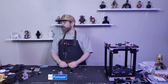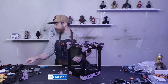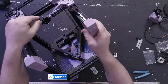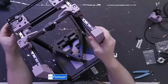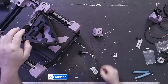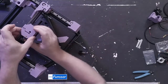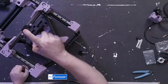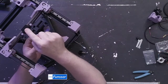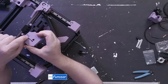And yeah, so if anyone's new to the stream today, I'm using a belt cradle for the Rook that has been CNC'd, and it's the main reason why we kept that belt cradle for the Rook when I did the Mark II, so that this tool head attaches to there. And if you have a printed version, it's one screw to get it off. It's behind there into this. If you have this CNC version, it's three screws. So it's the one on the back, and then there's two at the top. So that's why the tool head now has two holes right there.